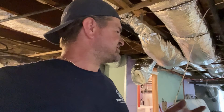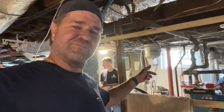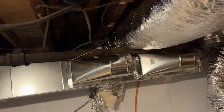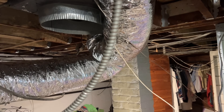This is just highlights of today's install. This actual install started around Christmas time of 2021 when the husband accidentally left the manual fill valve open for the steam boiler and flooded out his house. This supply plenum is about 24 feet long. Originally we had some duct board here and the furnace sitting on the ground connected to it. We ripped out all the ducts because they were all filled with water, and we're gonna bring everything up and make it look nice.